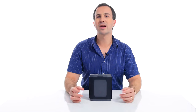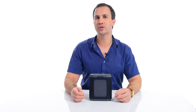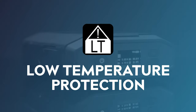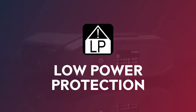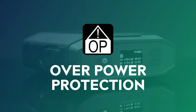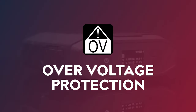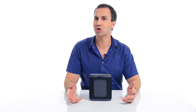Finally, there are a few screen icons I'm going to walk you through that I can't show you live. The first is solar charging — the icon that will appear if you're using a solar panel to charge your battery. Next are the warning icons. First, we have the low temperature protection warning icon. Next, we have the low power protection icon, which pops up if you're using pass-through charging and the output voltage exceeds the amount of input voltage coming into the battery. Then we have the overpower protection icon, which will occur if your battery is drawing too much power. We have the overheating protection icon if your battery is too hot. And finally, the overvoltage protection icon will appear if you plug in a power source that exceeds 32 volts, which is the maximum input voltage of the battery.